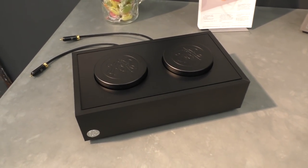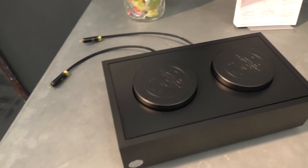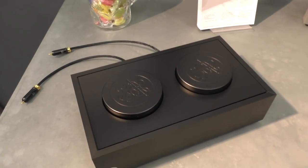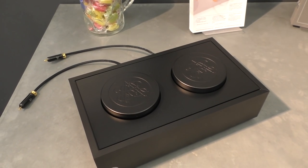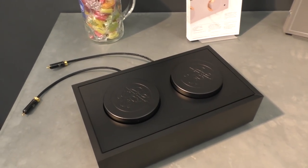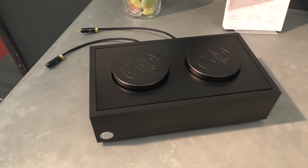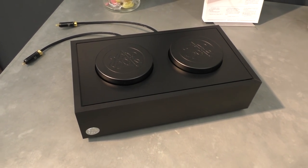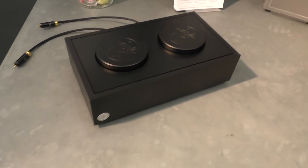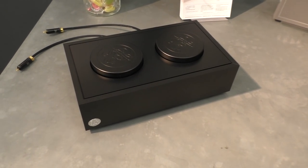Because we're bespoke and everything is handmade to order, rather than having a whole bunch of different options and switches, we can have a completely pure signal path and just tailor each step-up to the customer so everything perfectly matches. We're going to design the transformer so that if somebody changes their cartridge, we'll leave extra windings in there so it can be modified at a later date — they don't need to buy a new one. We'll almost certainly have loading on the secondary, possibly the primary as well. The ratio will be a fixed thing.